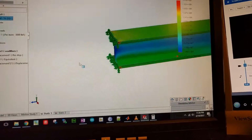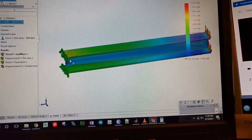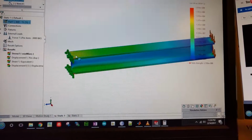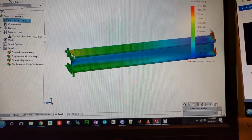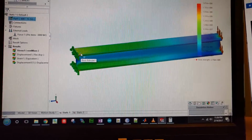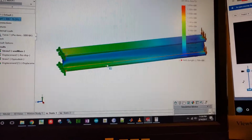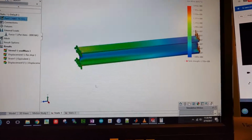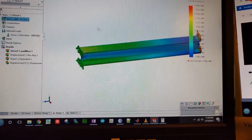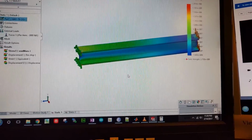But what's good about this situation is that when you're building this, as an experienced builder, you're certainly not going to just weld this end of the I-beam to the side of your boat and try to hang your tender off the side of it. What our calculations are telling us is that would work, but our safety factor is very small. What you're going to do, because you have experience building stuff, is put a gusset or something, either underneath or on top, and that's going to dramatically increase your safety factor and dramatically increase the amount of weight that the system can hold.